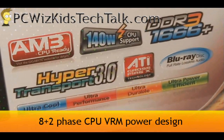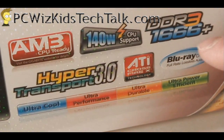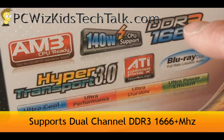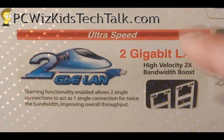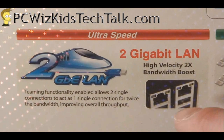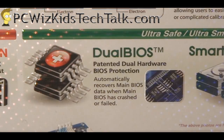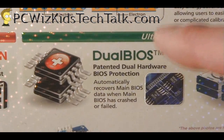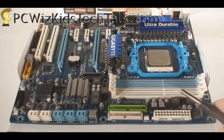Now it has support for 140 watt CPUs, right? And also DDR3 1666 megahertz and even higher if you can overclock it. So that's pretty nice that it has all that standard support. 2 LANs on it, so you can team them up, 2 Gigabit LAN connectors. If you have a router that supports teaming, then you can make use of that. Dual BIOS, so you've got a fail safe in case one BIOS fails. Your settings you can always restore.